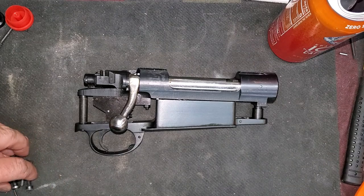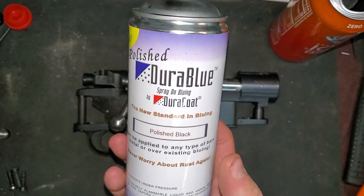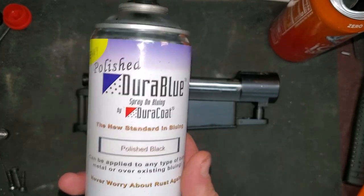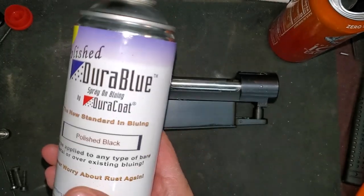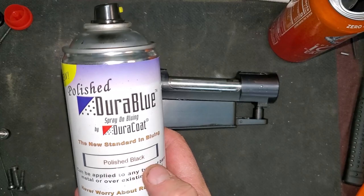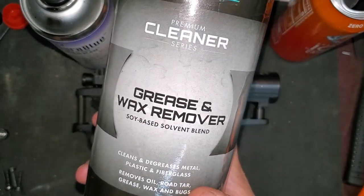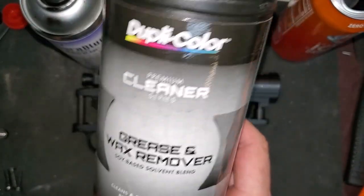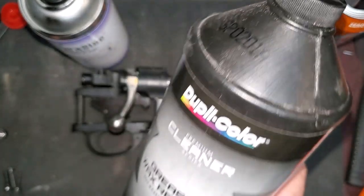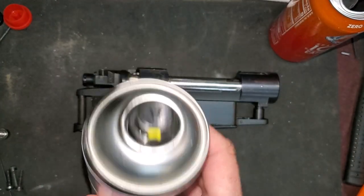Whenever I've got a firearm that needs to be coated, I like to do it at home. This is Dura Blue and this is really good stuff. I've actually done this to about a dozen big rifles and it works really well — it's very durable. I like to polish black myself, but this stuff comes out real nice. Just make sure you've got a super clean surface before you apply it. It's good to use a good grease and wax remover — it's actually designed to do this and does not leave residue behind. Just nice light coats all the way through, and that's how you get that job done.